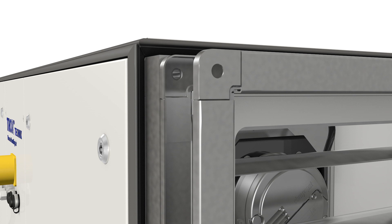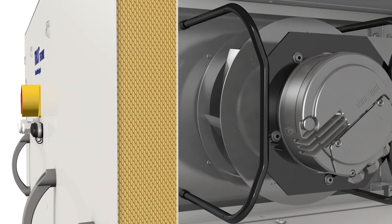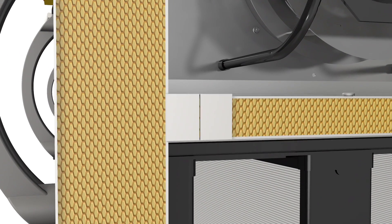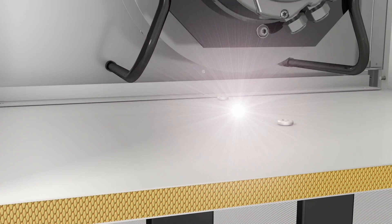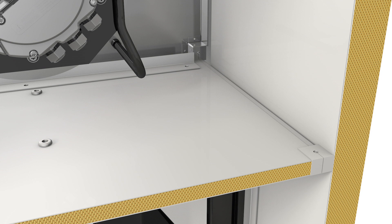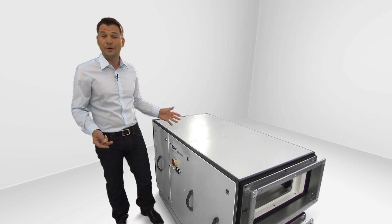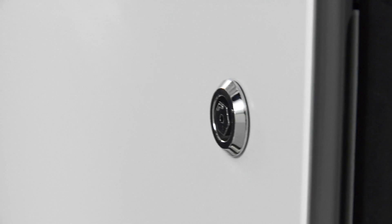One impressive feature of the X-Cube Compact is its innovative casing design. The casing incorporates thermal and sound insulation, eliminating thermal bridging both between the inner and outer skins and between the supply air and extract air sections. The internal surfaces are powder-coated, smooth, and without any protruding parts, making cleaning effortless. The coated steel frame is covered by an innovative panel construction. Panels can easily be removed for revision, cleaning, or modifications. Compression latches ensure panels close tightly with no leakage, and each panel is fitted with a seamless foam seal. The X-Cube meets the strictest requirements for leakage class L1.